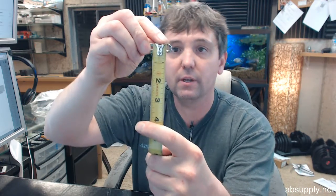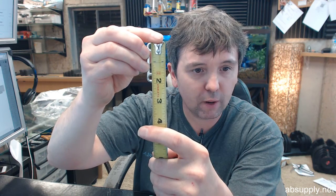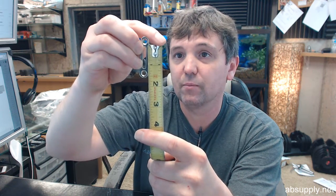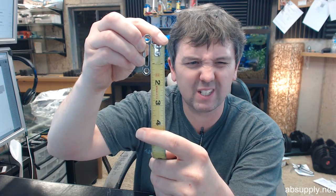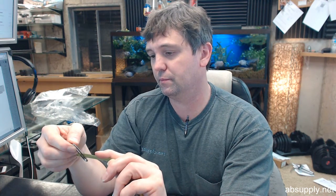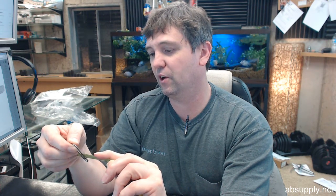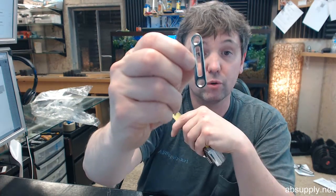Dimensionally, overall width is about 7/16ths. Overall height, about 1 and 15/16ths. Height of the slot that's in there is about an inch and a 16th, something in that range. Width of the slot, figure about 3/16ths clear opening width. We've got a couple of countersinks there for screws.